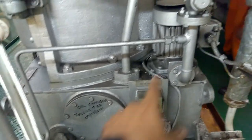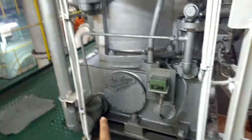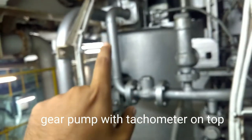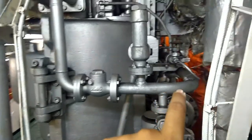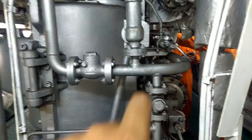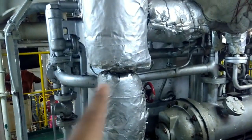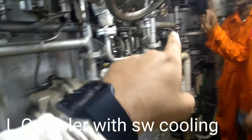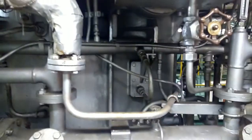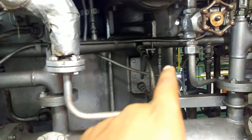This is the lube oil sump tank, this is a priming pump, and here is the suction. There is a gear pump attached with a tachometer on top. It goes through a non-return valve and then to the lube oil cooler. The priming pump supplies lube oil when the COPT is not running — this is a relief valve and the priming pump is always running. This is the lube oil cooler, cooled by sea water, and then lube oil passes through the lube oil filter and through flexible hoses which supply to the COPT.